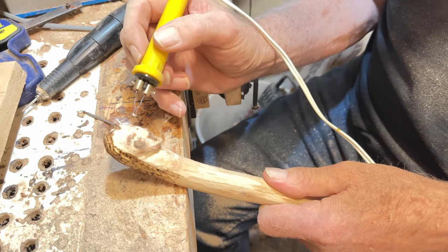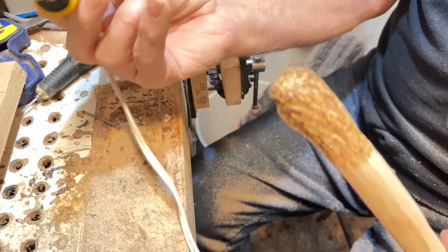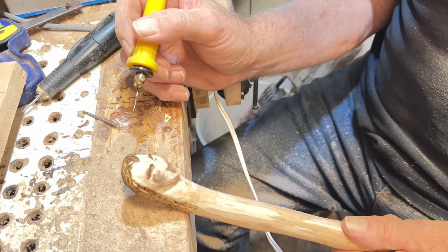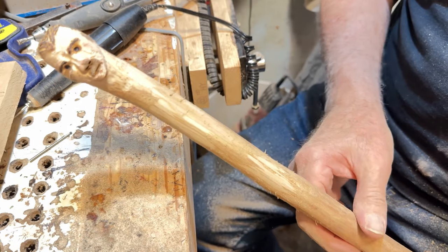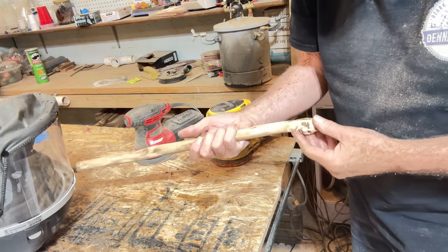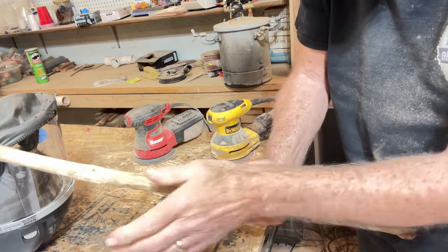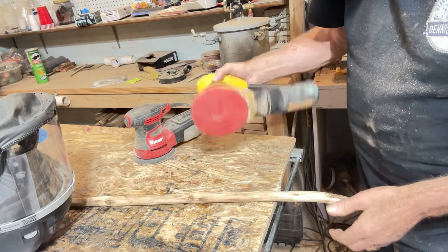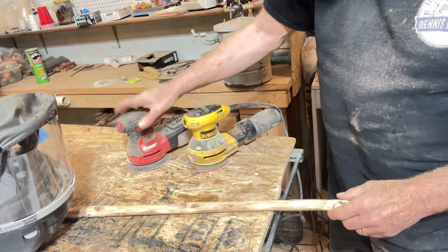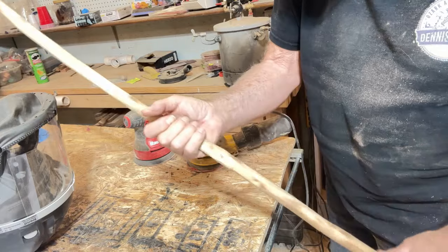Whether we like it or not — a little burning on the eyebrows. Now I'm going to put a stick back in with a ball shape and put some eyeballs right in there, darkening where the eyes are. Then I'll go over and sand the rest of the stick. Here we are with the sanding process. This time I didn't sand it first — I'm going to do 150 grit on one sander, then 220 on another. I'm not going to show the 220 but that's what I'm doing, and then we'll put a finish on it.